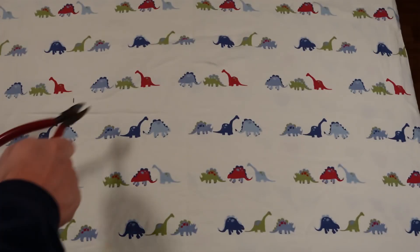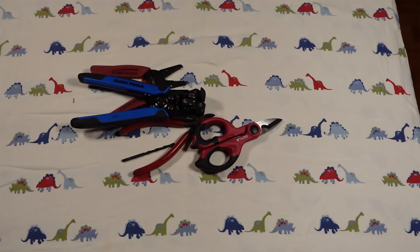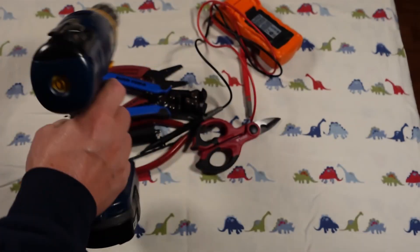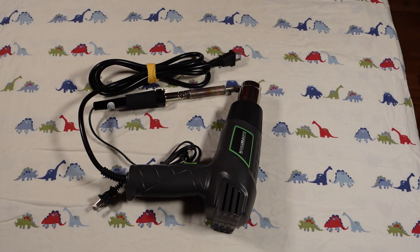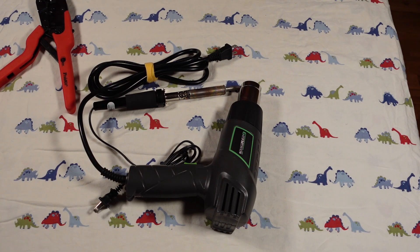I think I found almost everything I used in this build in those links. Also, please make sure that you know what you're doing electronically before you get started on this, because I don't want to see anybody get hurt — we're dealing with a battery. Before you get started, you're going to need some tools including, but not limited to: dikes, strip and cut wire, drill bits. This is not very thick plastic so you don't need any crazy drill bits. You're also going to need a hole saw — I have a one-and-an-eighth-inch that I use for most of the components that connect into the top of the box — a multimeter, a drill, electrical tape, and a sharp knife. Safety glasses are also important. Optional tools include a solder gun, heat gun, and if you are using power pole connectors, you're going to need your power pole crimping tool. Another optional one is a crimping tool for different kinds of connectors.